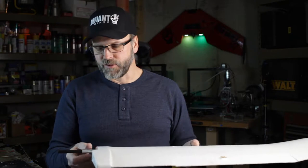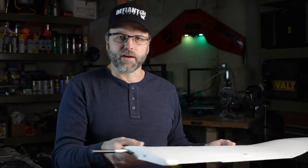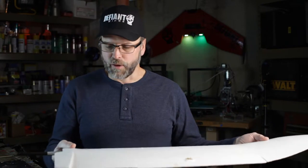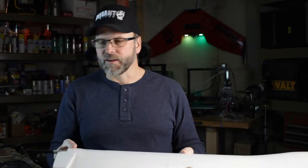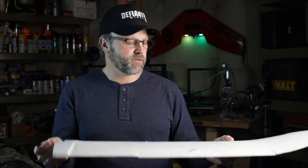So we're going to have to reinforce these wings somehow. One way is a more traditional method you're going to see in traditional foam airplanes — using a very large, stiff spar, usually right down the middle of the wing. In this case, you're deriving the stiffness of the wing directly from the stiffness of the rod. This isn't a bad method — it works well on these types of wings. This is a wing off a Penguin that Josh Noon gave me. But there are some drawbacks. One is that it can be heavy — that's a large chunk you have to put in here to make this wing stiff.